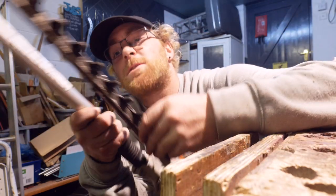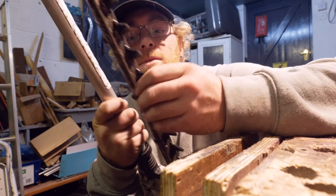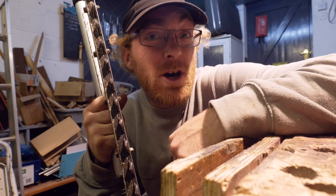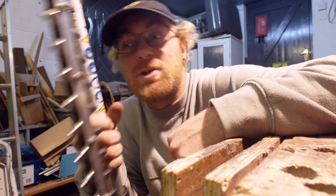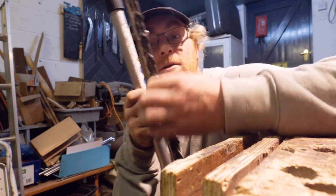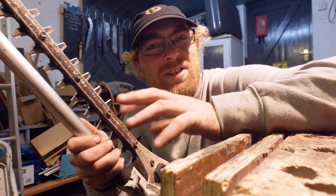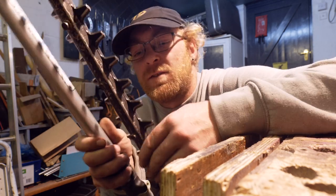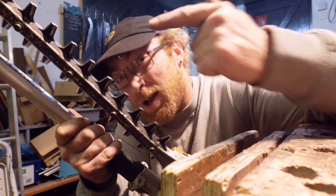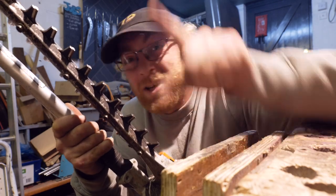There we go then. Some freshly sharpened trimmer blades. There are tiny little burrs on here, but as soon as you start cutting, they'll just come off. Working sharp, I'd say this is — not quite factory sharp, but it'll do the job. Next time we'll get all of this resin off, dismantle the trimmer head, give it a soak in some of Lewis's special Berio clean stuff. Hopefully that'll get all this off. Grind it sharp, then hone it in by hand. That's the plan. See you next time. Happy trimming, happy cutting. Stay safe. See you soon.